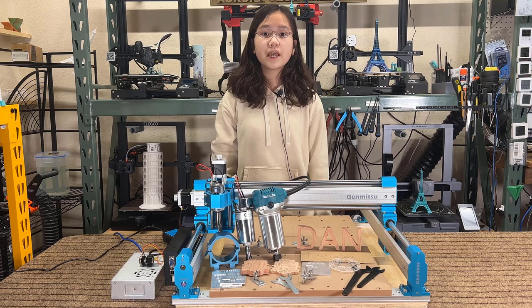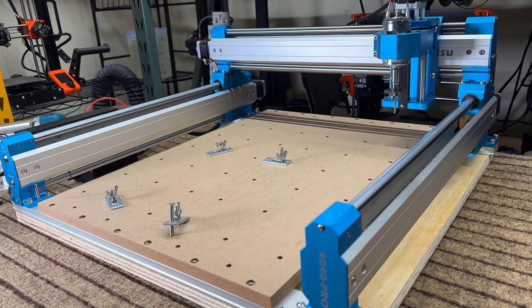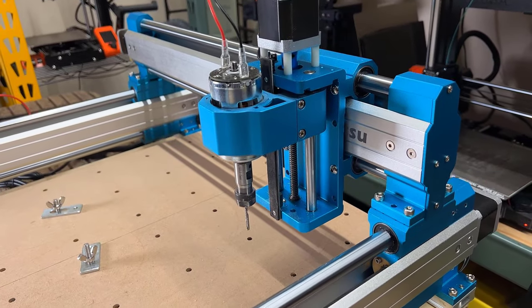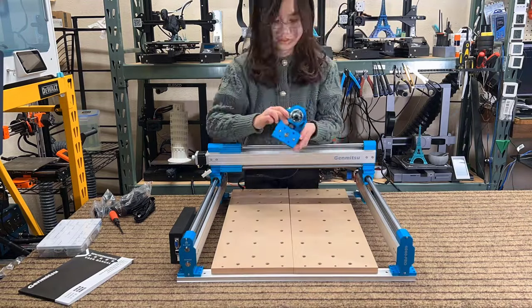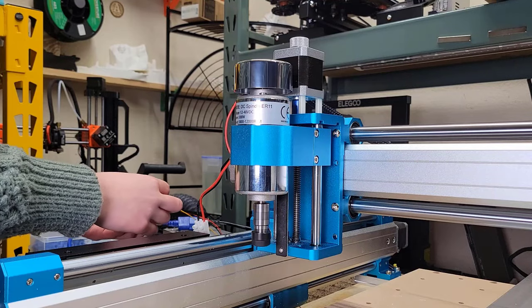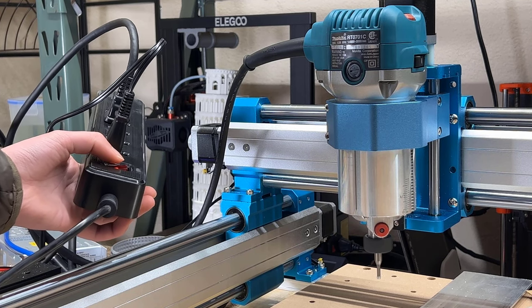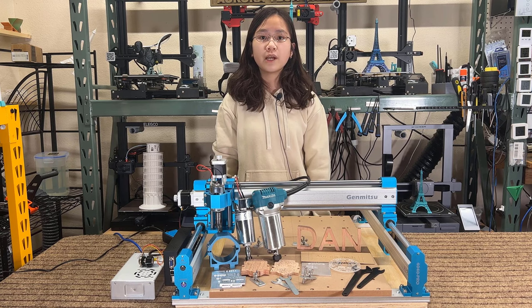Okay, let's talk about the pros and cons of this machine, starting with the pros. First, I have found this machine to be quite heavy and sturdy, even without mounting it on a workbench or having the extra thick wood board. The X and Y-axis with dual 16mm linear rods are rigid enough to handle most jobs. Second, the assembly process is relatively easy, especially compared to other budget CNC machines — you just need to lay it down on the table and tighten some screws. Third, I really like the flexible spindle upgrade options. The stock spindle mount is a 52mm mount which fits most 300W and 500W spindles, and you can spend another $30 to get a 65mm mount for a wood router like the Makita RT0701C. The cutting power on aluminum is awesome, and it cuts aluminum 13 times faster than the stock setup.